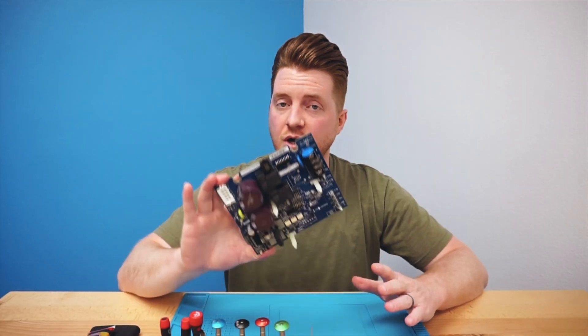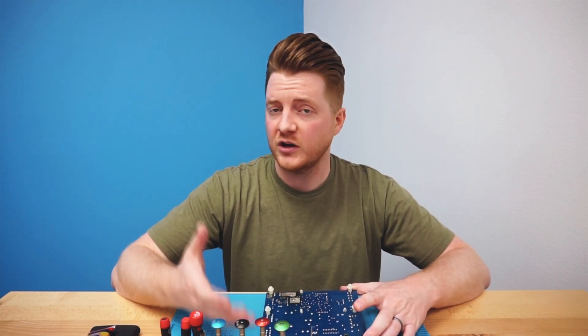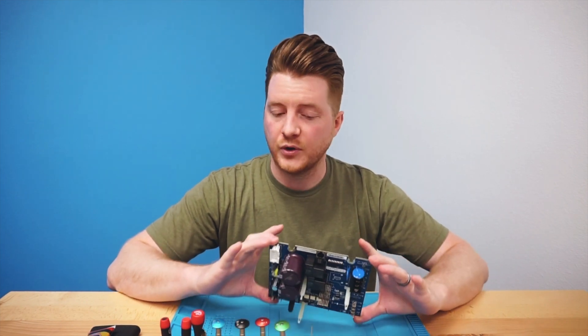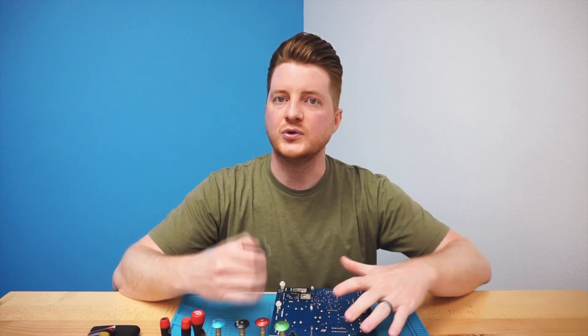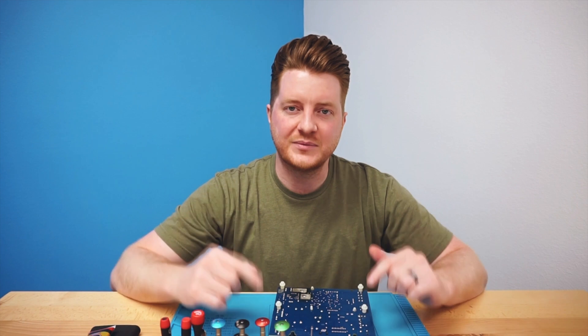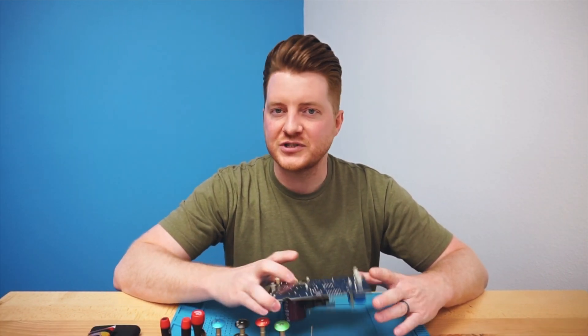Doing a job like this on a power board for a swimming pool can be kind of an advanced job. However, if you do have some soldering skills I'd recommend at least trying — just be very careful not to short out the board by touching the back side or front side, as there are powerful components like these capacitors that store a lot of power. Luckily on this one, using a little hot air and our iron, we were able to pull off the old thermistor and replace it with a new one. Everything on my workbench is linked up in the description below. Be sure to subscribe to our channel, hit the like button, and comment below what you'd like to see in future videos. I appreciate y'all watching, and I'll see y'all later.